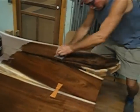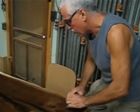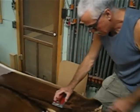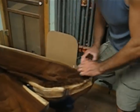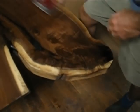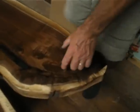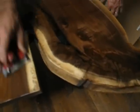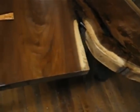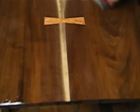Okay. I've got a tricky spot up here where I sand. I generally try and sand in line with the grain, but up here I have to come around the corner like this and follow this knot out. When I was dry sanding it, I noticed that if I went straight through, you could see tiny little cross-grain scratches in this tree branch that's taken off in this direction. Oh, okay. So, now you want me to do these inside? Not right yet. Let's focus on the top right now, and we'll keep going until we get the whole top done.